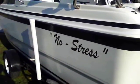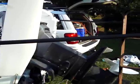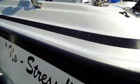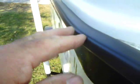So we finally got it stretched out, and as you can see, about 50 feet of rub rail went all the way around the boat, with plenty to spare. Now what we'll do is come back and pull the rub rail away. In the center of the rub rail is a channel embossed in the rubber. We'll fill that up with 3M 5200, and then squeeze it back in place, and then give it 24 hours of curing time.